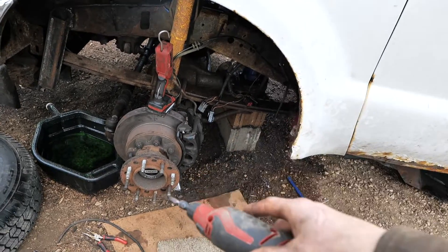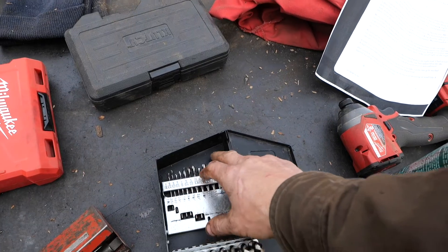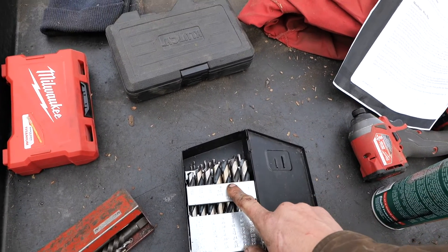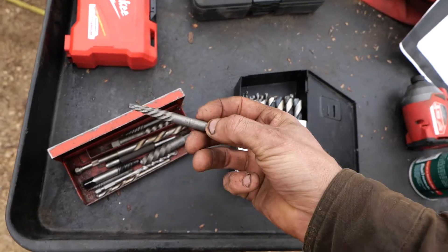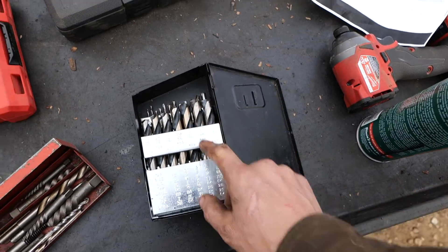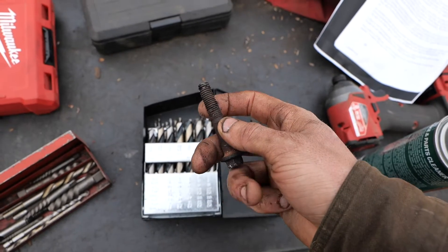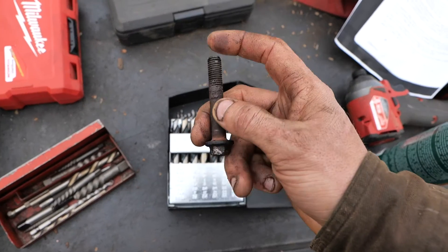Otherwise you're working down behind that framing member. I have good drill bits, but cheap so-called good drill bits will break off easily and get dull — I had to resharpen two of them. As I was drilling, I was catching on the bolt and actually saw the bolt turn, and I knew it was working. I then took a tool and began turning it out. Don't make the mistake I made — I had a drill that was the actual size of the bolt, when I meant to get a drill the size of the inner core of the tap I'd be using to restore the threads.